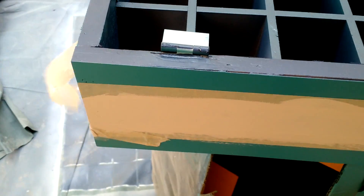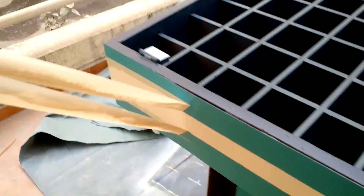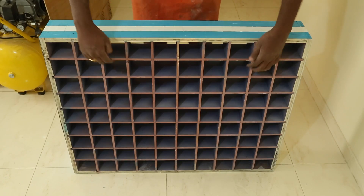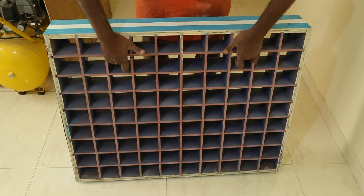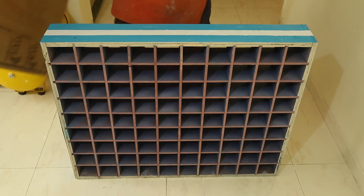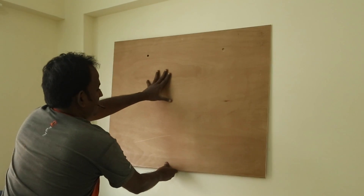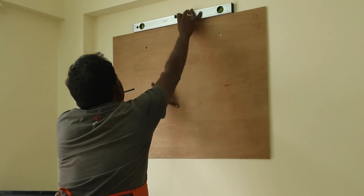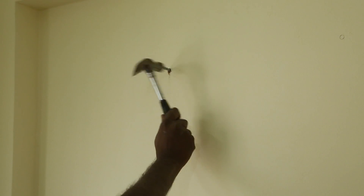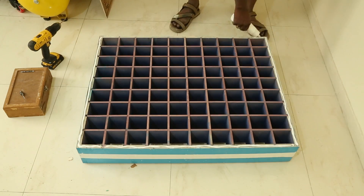Then I took it outside to give it a simple paint job. Initially I thought I'd put two screws here and hack it to the wall, but then I found it's just MDF and it might bend. So I decided to use a backer board — if I screw it in on all sides, that will carry the entire weight. Drilling the holes in the backer board first was a great idea because I can easily set it on the wall and mark where the holes need to be drilled. The backer board gets attached using glue and screws.